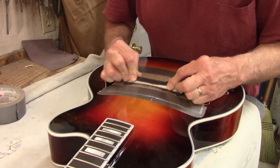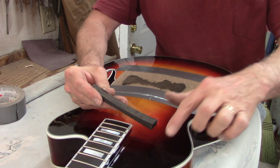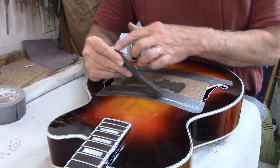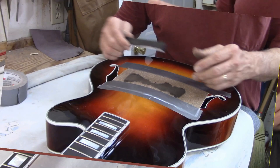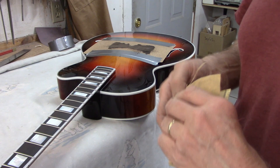I've got dust all the way across, and I can see sanding scratches all along the bridge base. Now I'll take off the 60-grit paper and do the same thing with 100 and 150 grit, just to remove the sanding scratches, because they are deep enough with 60 grit that eventually they would mar the finish on the guitar. Then I'll clean this up a little bit with some 220-grit paper. This doesn't really change the profile at all — it just smooths out the 150-grit scratches.